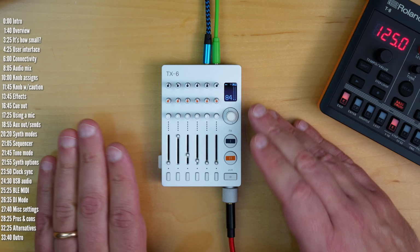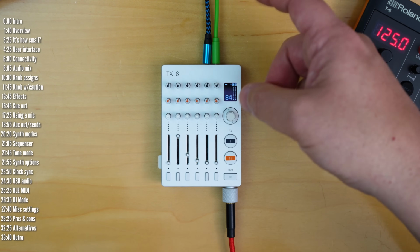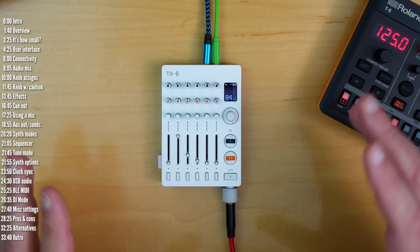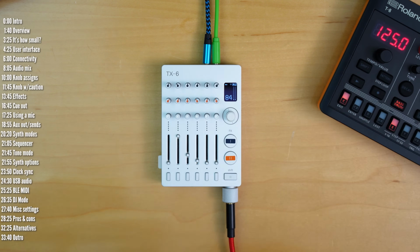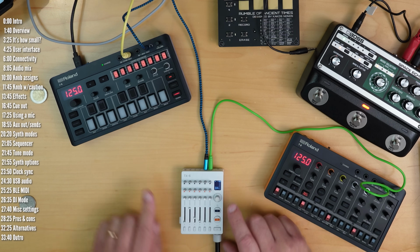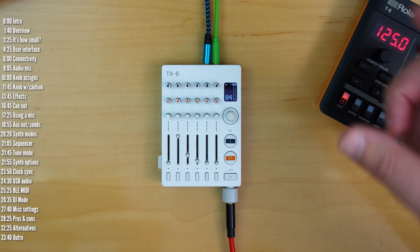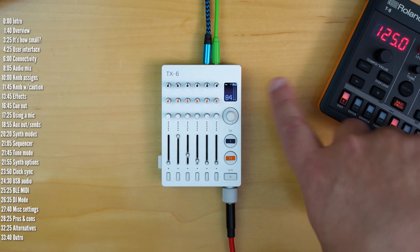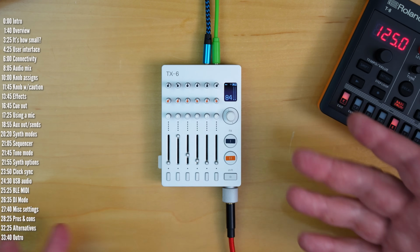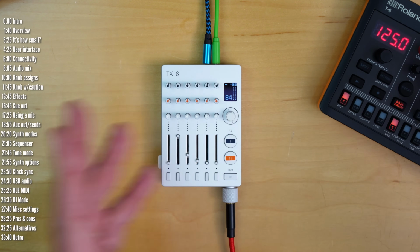Yes, they're fun in a portable pinch, but as far as the sequencer and synth are concerned, without analog and TRS MIDI sync or chromatic control of the synth, you'd probably just be better off getting an external drum machine. Though, like I showed you in the intro, in a pinch you can use them if you don't mind syncing the tempo manually. Now, you could potentially use a USB MIDI host to sync this over MIDI or sync over USB and Bluetooth with a computer, but that setup might get so convoluted you're better off just using an external synth or a DJ app on your phone.